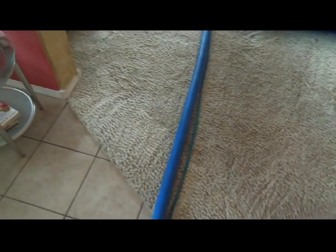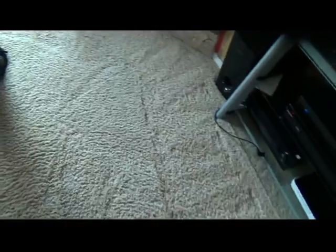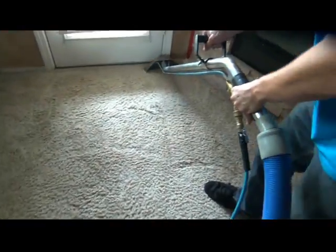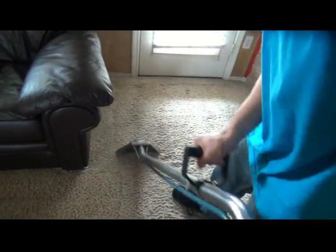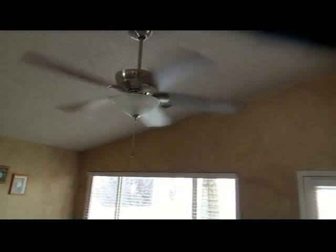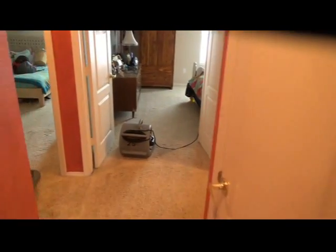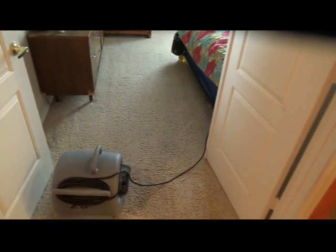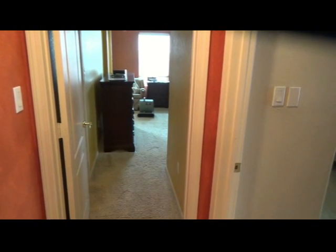You can see where Jake has edged the very different color of the clean carpet versus the dirty carpet that hasn't been cleaned yet. We've been seeing the change in color at every step — when we vacuumed, when we shampooed, and now especially as we're rinsing out all the dirt we've loosened. The ceiling fan is our accelerated drying process. We also have air movers installed throughout the rooms we've cleaned. For premier service on this job we have four air movers, so this carpet will be nearly dry when we're done. The only caveat is we're adding Teflon, which adds more moisture.